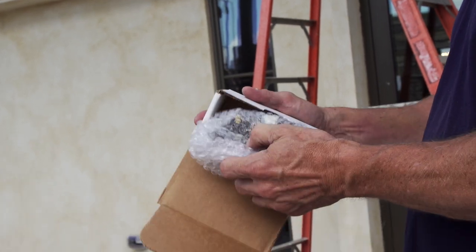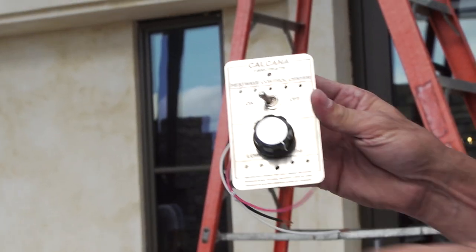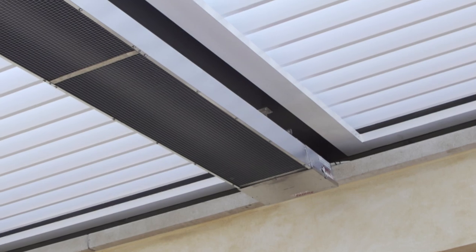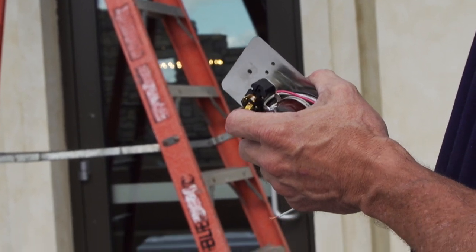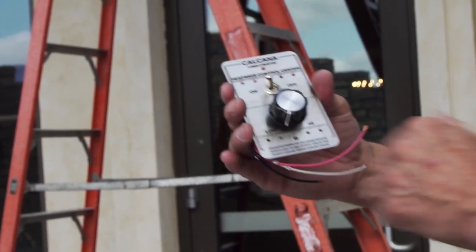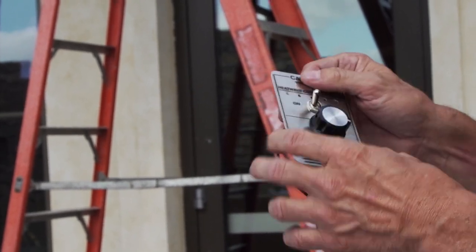You may already be asking, how do I control a unit once I have it powered up and piped? The answer is right here. We have a controller that has two components on it. We have an on/off control. This is a low-voltage system, so we need to bring low voltage to wherever we mount this — typically on the outdoor wall of the patio, though it could be mounted indoors. We bring low voltage wires to wherever we're going, and these wires come back to the control panel on the unit. Once those five wires are connected — and there's a wiring diagram right in the unit on the inside of the stainless steel cover — the operation is fairly simple. There's an on/off switch for turning the unit on and off, and then a modulation control from minimum to maximum output. It turns just like a volume knob, low to high, to set the amount of heat output to wherever you'd like. Very simple control, but very effective.